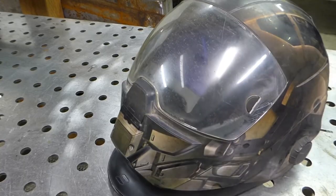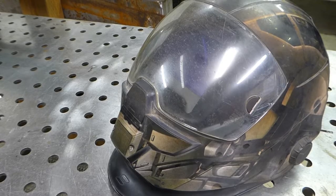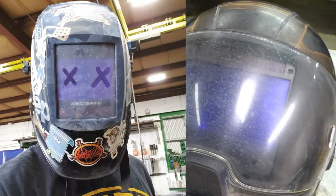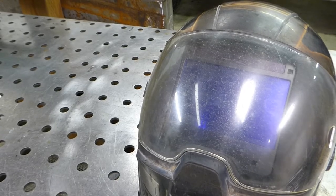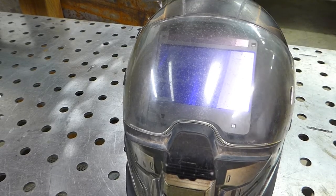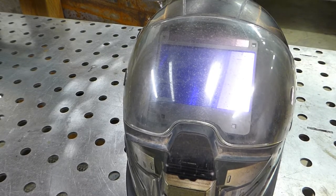I find of all the hoods, the messiest process I use is MIG welding aluminum with a push-pull gun. I run it with an argon helium bottle. It leaves some nasty residue behind. All my screens get basically just ruined from the stuff. But this guy gets ruined faster. And the screens are about like, I think they're like $4 to $5 a piece. Maybe you can get them a little cheaper if you buy them in bulk. I think they sell in packs of five.